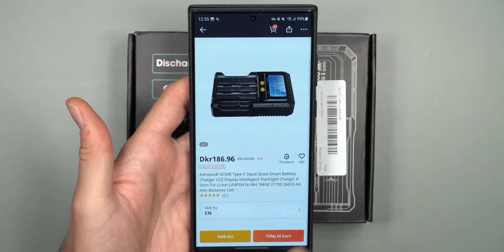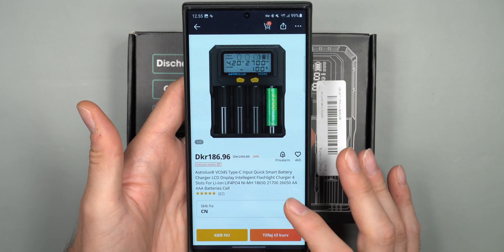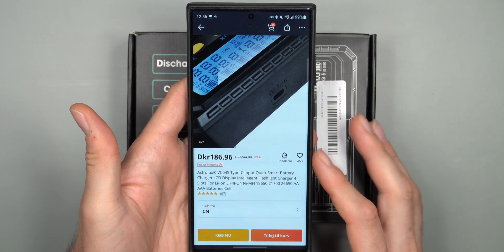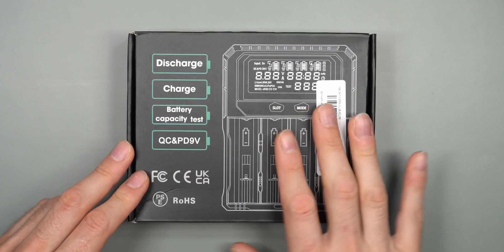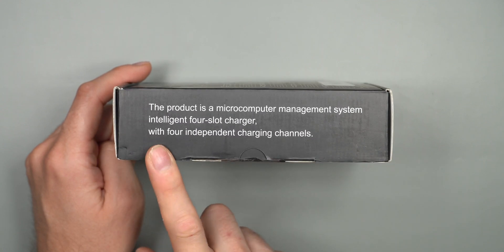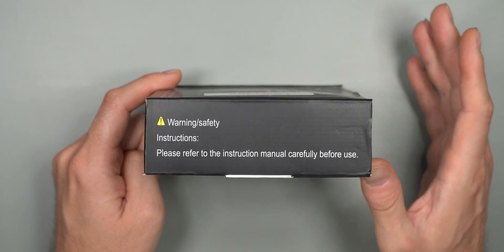In this video we'll take a closer look at this fairly inexpensive charger that can charge standard nickel metal batteries but also lithium iron LiFePO4, and can charge pretty much any size cell — standard double-A, triple-A, 18650, 21700, and 26650 batteries. This is a microcomputer management system intelligent four-slot charger with four independent charging channels. It also has smarter functions: you can discharge, check capacity, and select various charging amps up to around two amps.